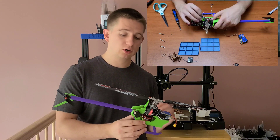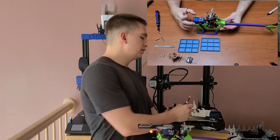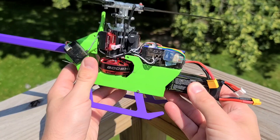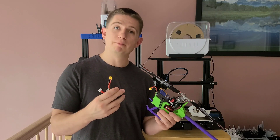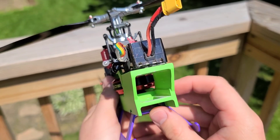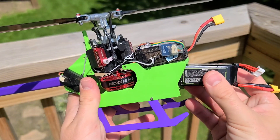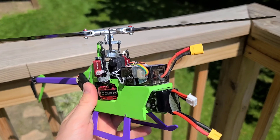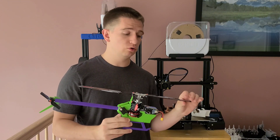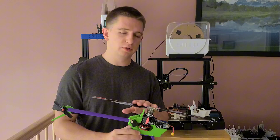The last challenge was the battery fitting into the battery compartment. I was barely able to put the battery in. Due to tolerancing, I didn't realize how much of an impact the resin printing combined with the matte paint finish on the airframe would have. I ended up having to file down the top and bottom of the battery compartment quite a decent amount just to fit in the batteries. That all being said, it looks phenomenal. It is fairly heavy, and I'll definitely be using my original blades since I'm more confident they'll be able to handle this weight.